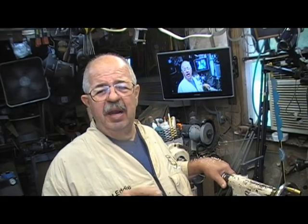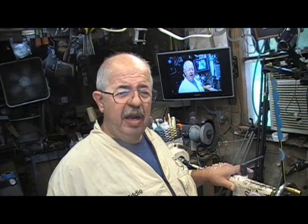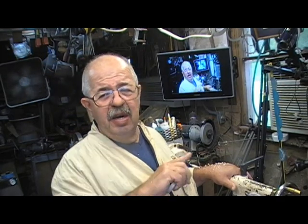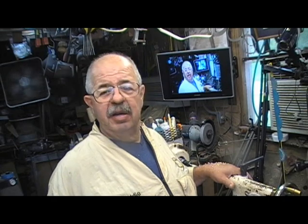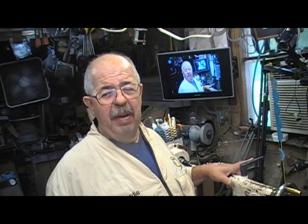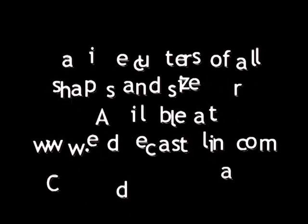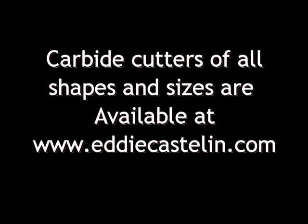I just added this on the back end of the tip video because I'm always getting questions: what's a good cutter combination to do pens with? I can do them with the round and I can do them with the R2. I'm wasting my time with the square because the square cuts on the corners and you can't do that smooth planing cut very well. So I'd say the 16mm, the 18mm, and the R2 — that's a package. It really is. See you next time.